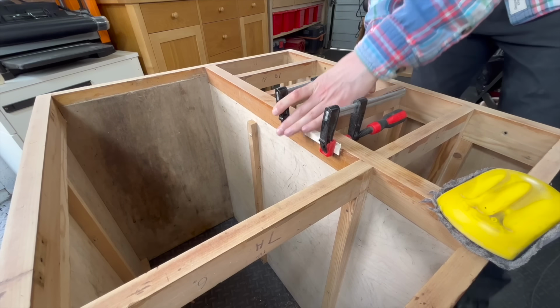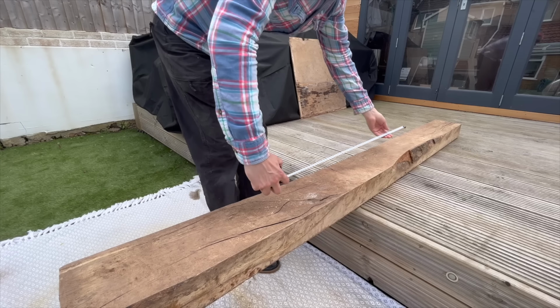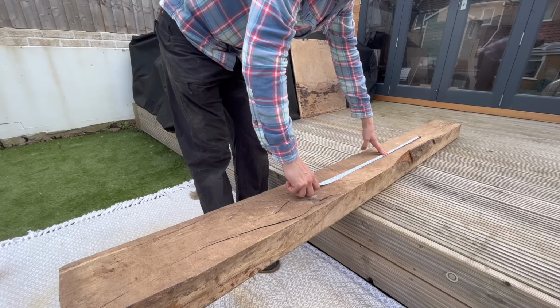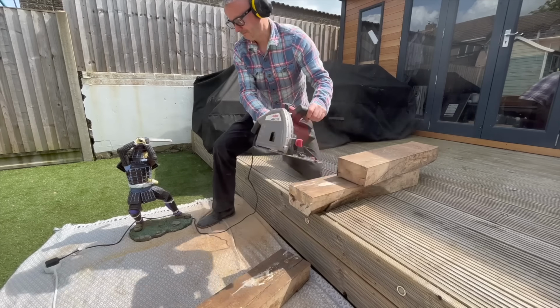Have I mentioned I got a new fancy Benzo? So I decided to cut my own veneer. Actually, not veneer, more like boards, something in between. So I had this piece of wood, but because it was really badly cracked, only the middle section was usable. So I didn't have enough to work with, and I had to make the boards thin enough to have enough, but thick enough so I could actually do something with them if I needed to, as in put it through the thicknesser.